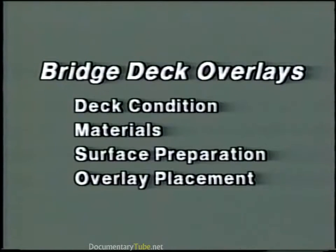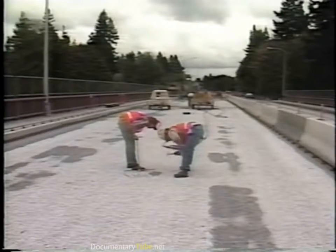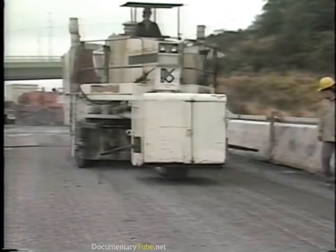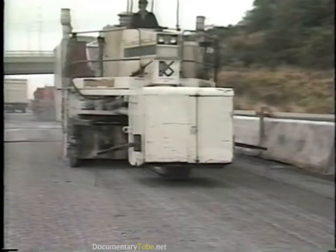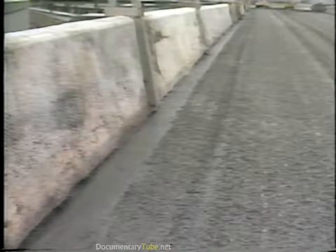After the deck has been selected for overlay, the next step is surface preparation. All deteriorated, delaminated, and spalled concrete must be removed and the surface must be properly cleaned prior to placing the overlay. Most often the process begins by scarifying the top surface of the deck to a depth of at least one quarter inch. Scarification using automatic rotomilling equipment must be done carefully so as not to damage any steel lying close to the surface. Because the equipment is not capable of reaching all areas, considerable handwork may be needed near curbs and joints.